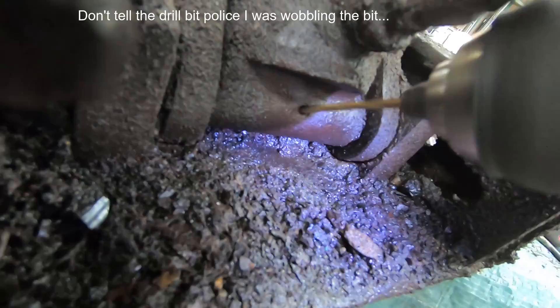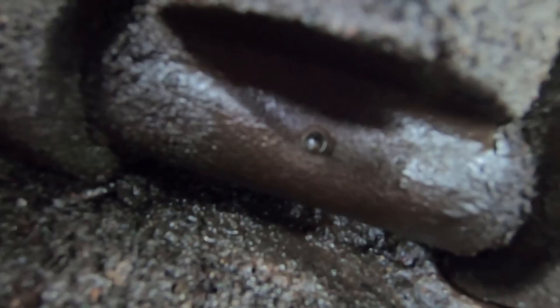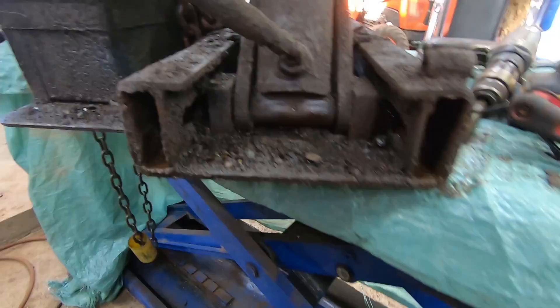So what I'm doing — I'm not trying to drill it through, I'm just trying to clean the rust out of there. And now you can see some shiny metal in there. If I get out of the light, you can see some shiny metal. I'd blow that out with compressed air too, and after you do that you're going to be all set up to weld.